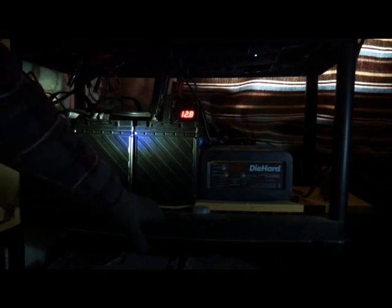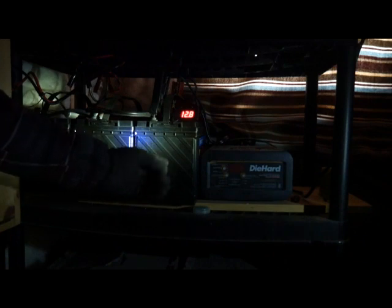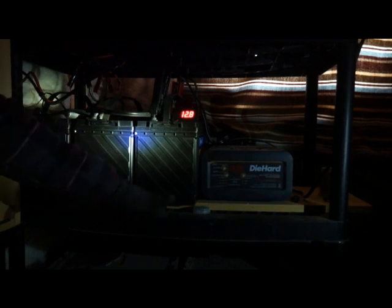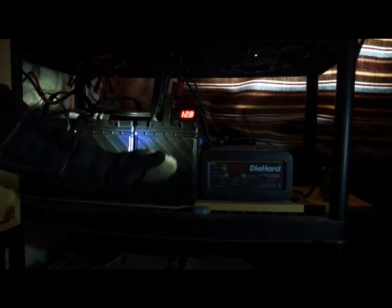Back inside in the room with my water heater, pressure tank, and water softener — in the first three days of an outage I run the generator for one hour on and three hours off. That's enough to keep everybody warm, keep everything charged, and I do that around the clock. It uses a lot of gas, but I have plenty stored. No big deal for the first three days.